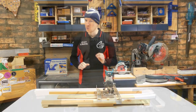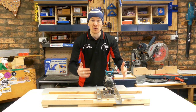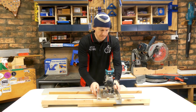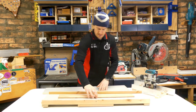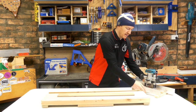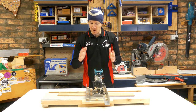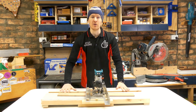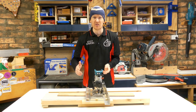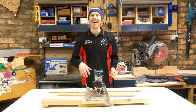Extremely handy, and the last little trick I'll show you with it: because you only have a certain plunge depth, if you want to get even thinner, you can use a second piece, clamp that down, raise your bit up, and that will allow you to do some tricky mortising, some fine detail work. Honestly, I find so many uses for this router sled. It's another one you're going to want to add to your collection early on, and you can even do some wacky stuff like turn it into a drum sander — that's a video for another time.